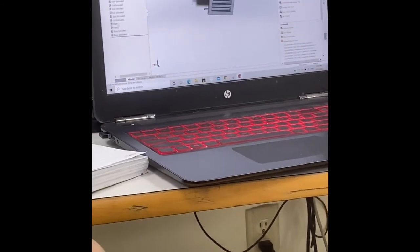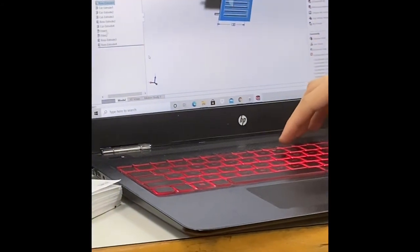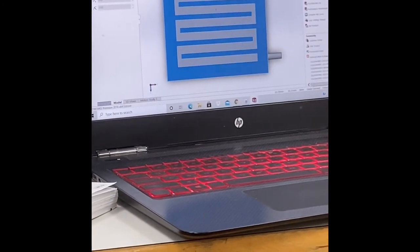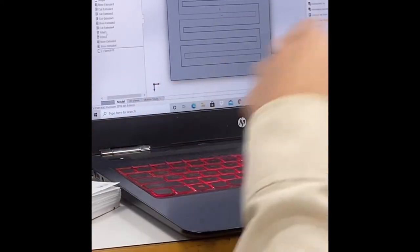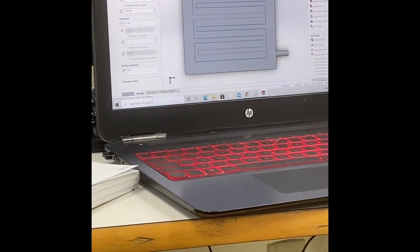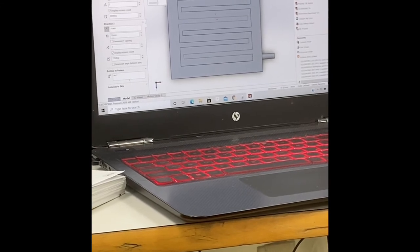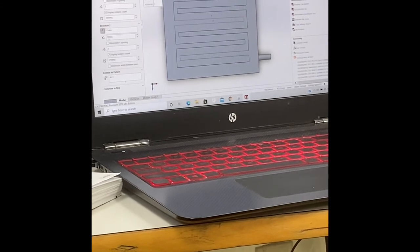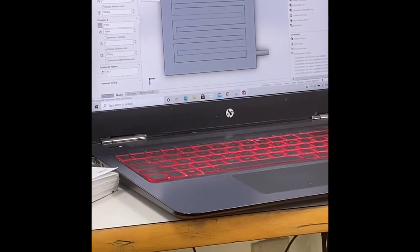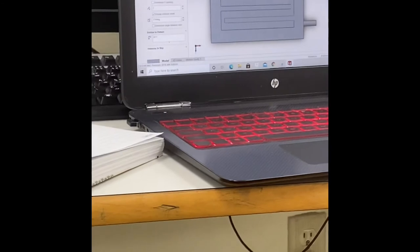Okay. After that, we'll have to make holes so that we can attach a cooling sheet metal on that surface. So let's sketch, make a hole there. Just randomly make a hole, and we need 4 holes, so this time we can use mirror in both X and Y. Let's go on the reverse. Okay, so now you can randomly give them some numbers and then make a good reference. Let's say 125 millimeters. Okay, and the Y, let's say 125 as well.